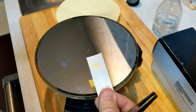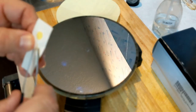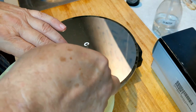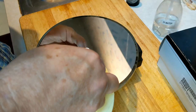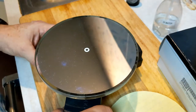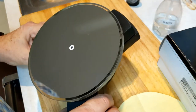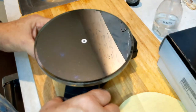Using a pair of tweezers and one of those little hole reinforcement circles from the collimation box, I peel one off and gently hold it in the tweezers. I use the paper cutout we just made to rest my hand on without touching the mirror, and I line up that circle exactly where I had the dot from the Sharpie. I hold it down with one end of a pencil, set it aside, then use a finger to press the circle down — and there you have it. You've found the dead center of your mirror for collimation purposes.